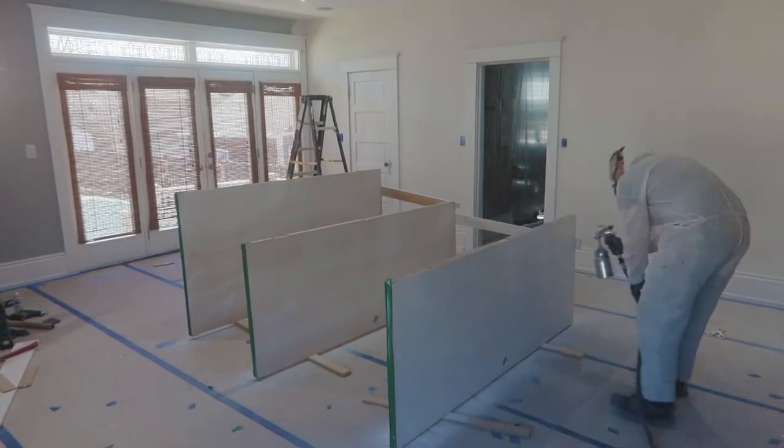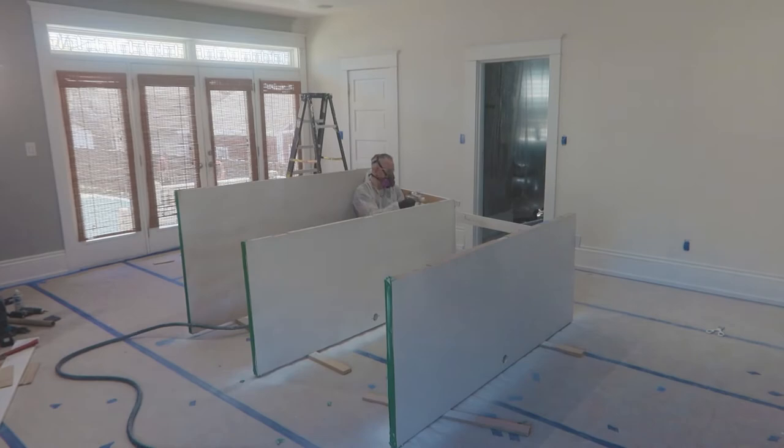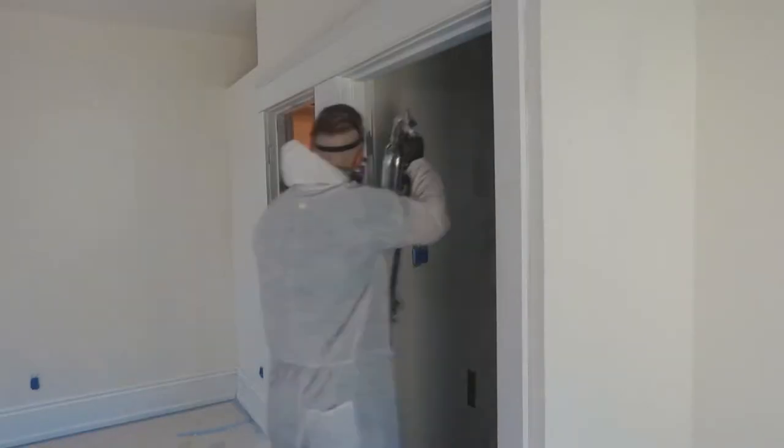The runs are definitely solvable, but it takes a little bit of elbow grease, really. So you pretty much have to sand it smooth. Just gonna give them all a nice light sanding, wipe them down, and do it again. And then we're off to paint. Actual paint.